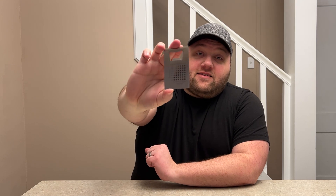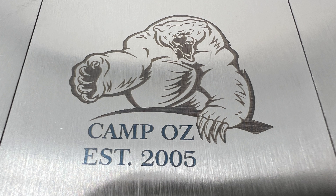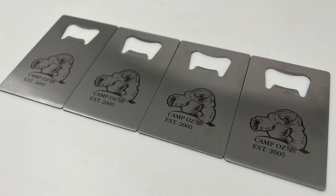I don't think this one's truly stainless steel like the other one was, so I ran another test grid to be safe and the settings are slightly different. I think this is a 205 rating of stainless steel where those cards were a 305 — I could be getting those numbers wrong — but you do want to run test engrave settings for each type of material. I'll throw up a photo of an engraving I did on these for a couple friends — you'll see the black and blue coloring, text in blue and the bear in black, and that turned out really great.